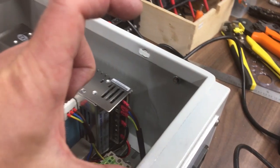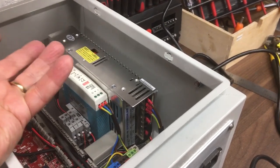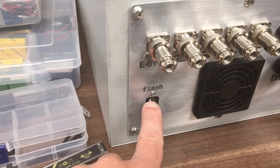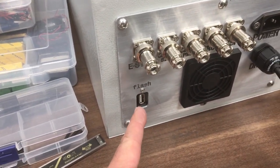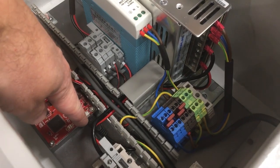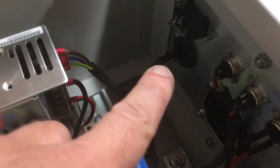It's quite a large unit with good-sized component values, so hopefully it'll give good performance. It's specifically designed for hi-fi use, so hopefully it'll do the trick, and there is space to mount it down there. The USB port in the corner is now screwed in so we can flash the microprocessor whenever we want to change the code or change parameters — the ratios are set up incorrectly at the moment. On the other side that goes down to a micro USB.